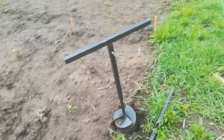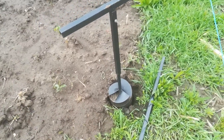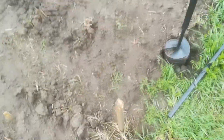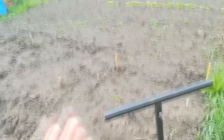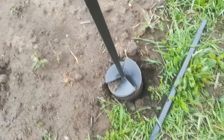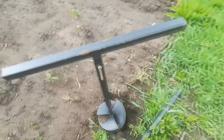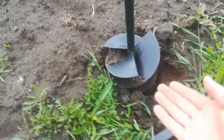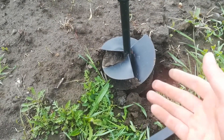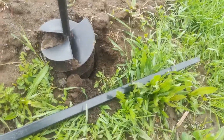I'm not even sure you can dig in ground filled with large stones and gravel because you'd just ruin your earth auger. The way I did it: I had soil without any stones or roots, and I bought one of these cheap manual earth augers from Amazon. The way it works is you rotate and it digs itself into the ground, then you pull it out and remove the soil from between the blades. When you're far enough down, you add another metal adapter so you can keep digging deeper.